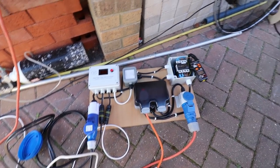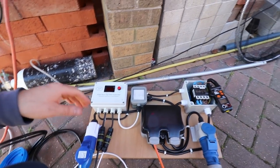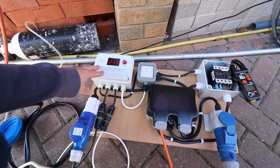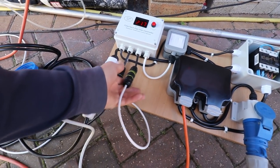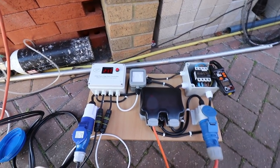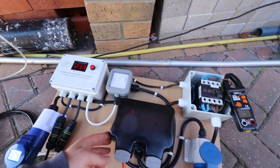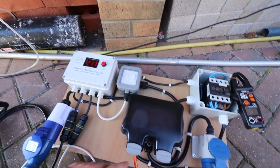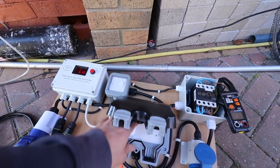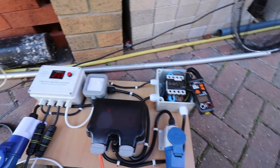We're ready to test. I've plugged in the pumps and I know power is going through the system because they're working. I've plugged in the thermostat and flow switch - it works, reading 21.7 degrees which seems about right. I was skeptical about going through those connectors but it seems fine. To test the flow switch safety feature - if I turn the water pump off, the controller should go into a no-heat mode. It works - with the pump off it won't run the heater, and when I put the pump back on it goes back into working mode.